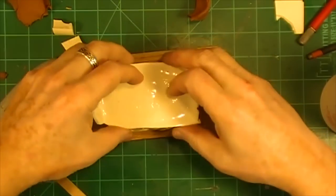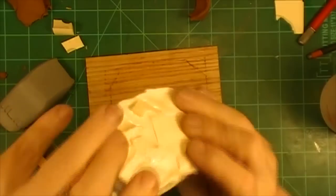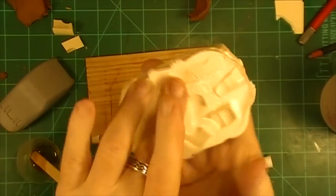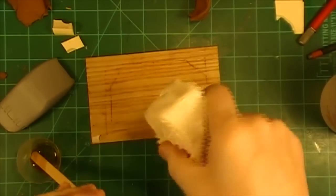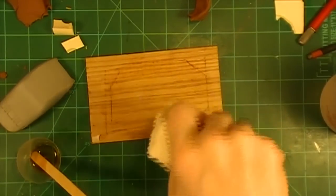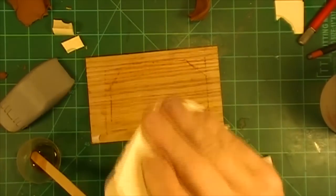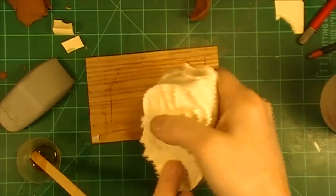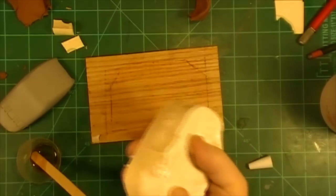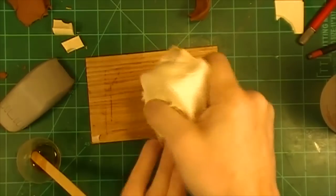Now, seal up the mold. And then just pick the mold up and keep it moving around and around. The idea is to coat all sides of the inside of the mold before it cures, obviously. A better way to do this is to actually put it between two flat pieces of board, cardboard, or whatever. That helps hold everything closed.